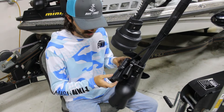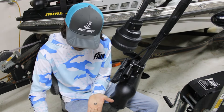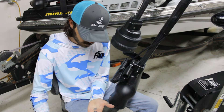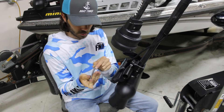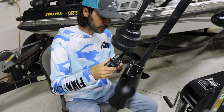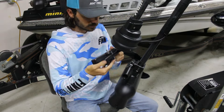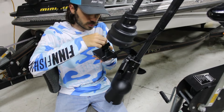The LVS34 is probably the trickiest part of this installation. In the hardware bag you'll find a long bolt, two flat washers — one smaller and one larger — a half-inch nut, and four cupped Belleville washers. First, put the small flat washer on the bolt. This threads through your transducer — make sure it's on the right side. If you're on the starboard side, it faces this way; port side, it faces the other way. Then put the bracket on, followed by the large flat washer down on the bolt.